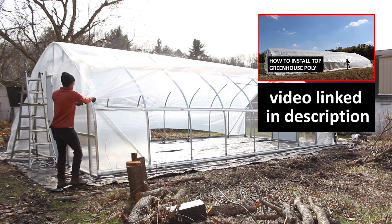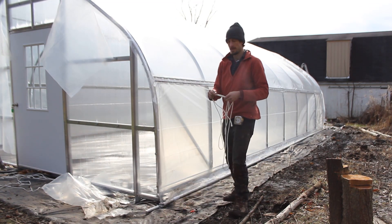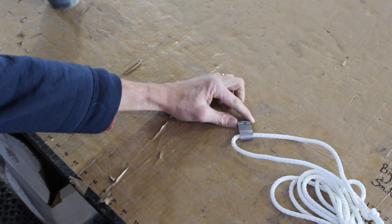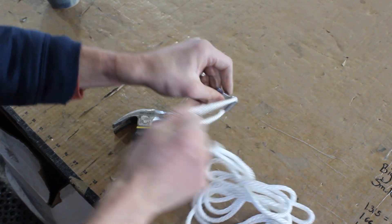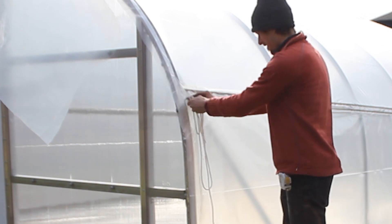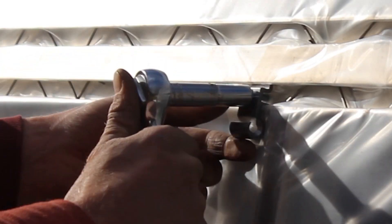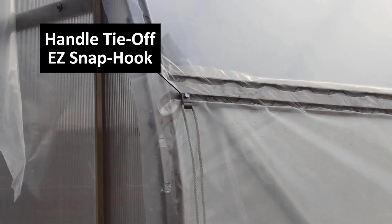You won't do anything else with your handle tie-off until you put the plastic on your structure. We do have a video for this process, and I'll link to it in the description. Once your plastic's in place, you can now do your handle tie-off completely. Here I have a 10 to 12 foot long piece of rope. Where I've folded the rope, I've already put an easy snap hook on, and I've tapped the easy snap hook's open end so that the rope can't easily pop out of it — I've essentially crimped it with a hammer. Now I'm going to insert the easy snap hook into the double channel where I've pre-drilled a hole. You'll push in the bolt from the exterior, have someone on the interior hold the lock nut with the crescent wrench, and tighten with a 7/16 inch deep well socket from the exterior.